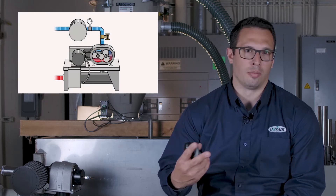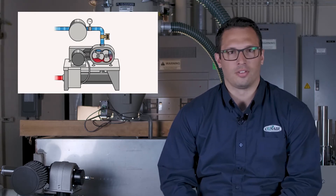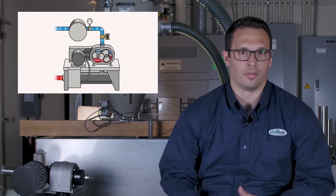The next style is the positive displacement pump — typically a two-lobe style. This is the workhorse of the industry; this technology has been around forever in the plastics industry. Capable of 10 to 12 inches of mercury, maybe 14 if you make some alterations to the relief valve and run it at its max. Overall, this pump handles roughly 500 to 600 feet of equivalent distance, plus a decent amount of throughput. There are different horsepowers and pump frames we can size into a system to encompass most applications.